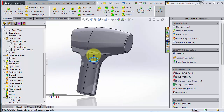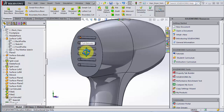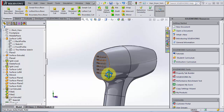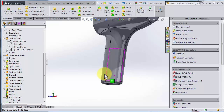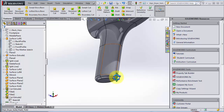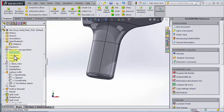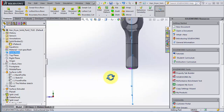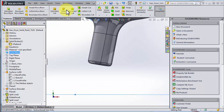Next step is to make this into a shell. When you make a shell and have made almost like holes here, the shell will add thickness all the way around, which is pretty cool. We could use that by adding a cavity for a screw. Let's add a cut here — let's see if we can do a revolved cut, using the front plane in the symmetry plane, making a little line and revolving around it. I go for revolved cut.